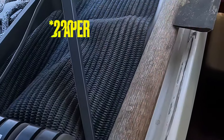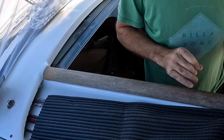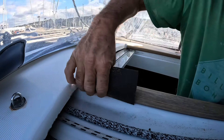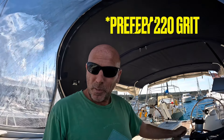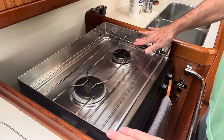This is before, and this is after. 120 grit sandpaper — you'll see I'm starting to sand here, just got to get through this green a little bit. You just want to knock down the ridges; you don't want to keep sanding into the wood once you get the ridges knocked down. It won't be perfectly smooth but it'll be a lot better. Don't go above about 120 grit on this softer wood so you don't close up the grain. Wow, that looks so much nicer.